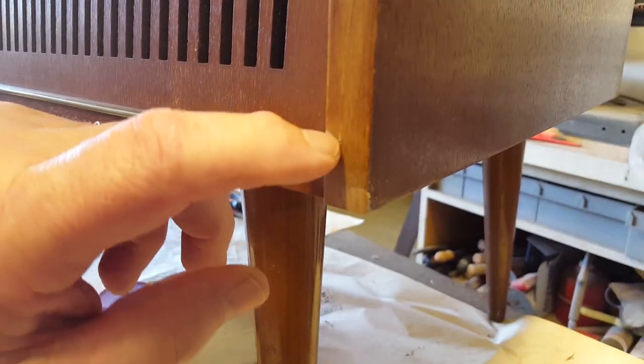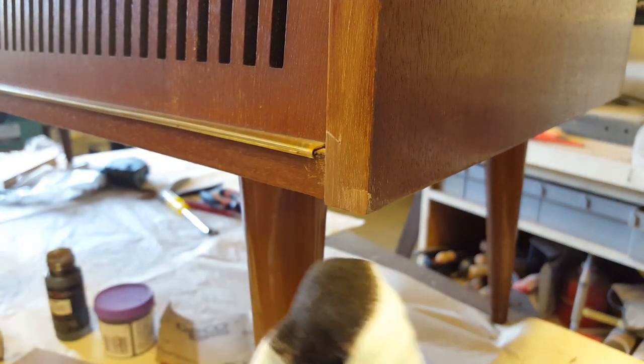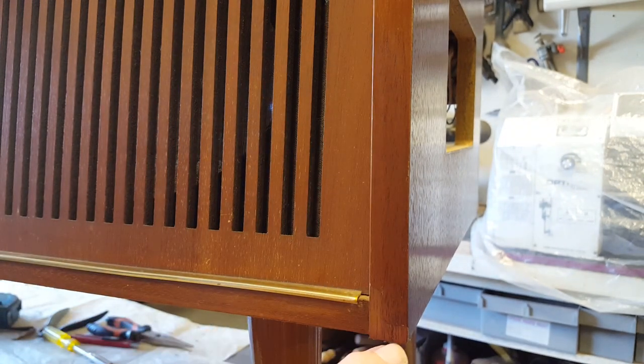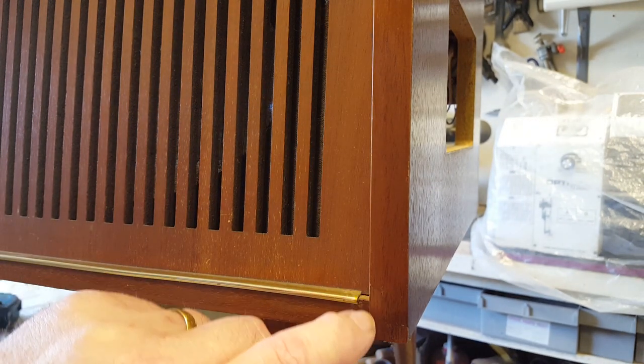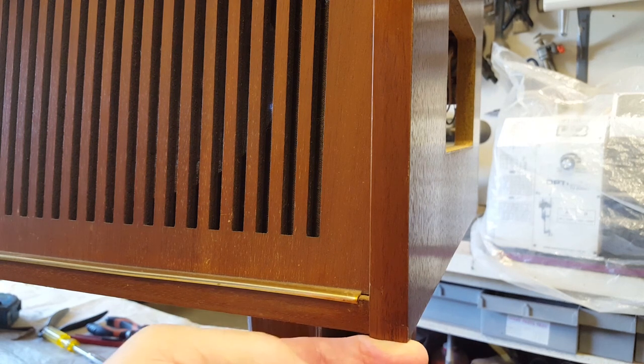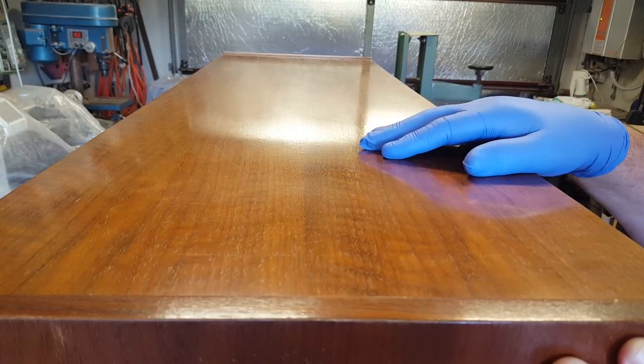Most of the repair is invisible - it's just that one line. This is the oak stain I looked at the other day and I think it'll be very close. It needs to be rubbed off - it's still wet, and as it dries it'll dry a bit lighter. You can see the repair line - whenever you put filler it's going to stand out a bit - but overall it looks pretty good and when you stand back you're not going to notice it.